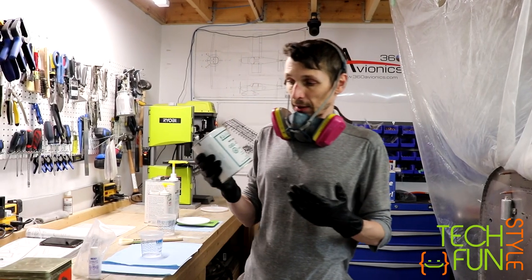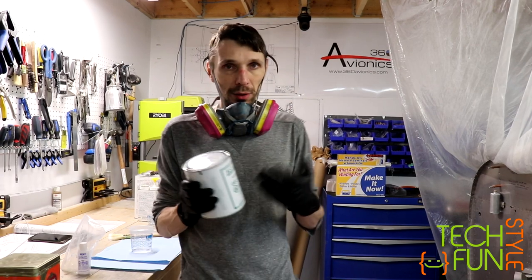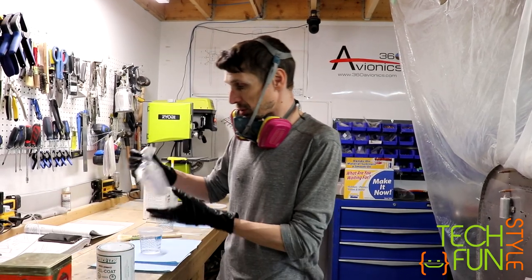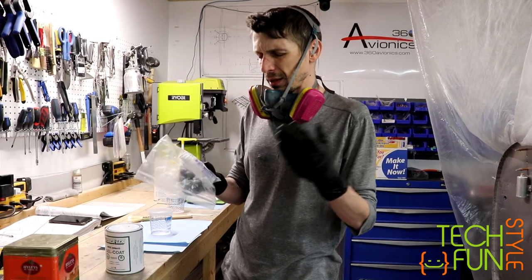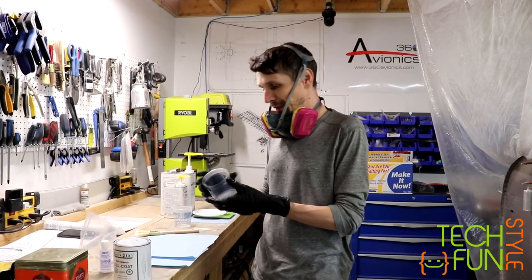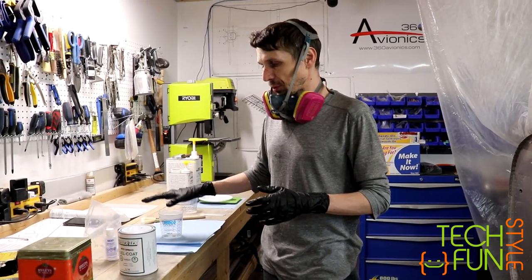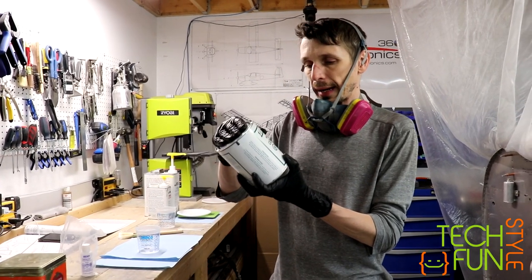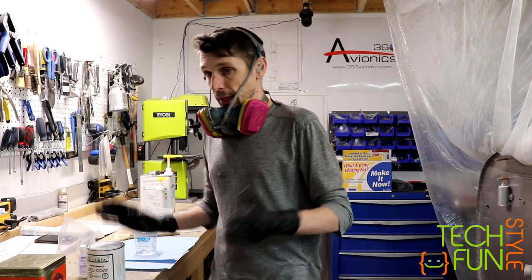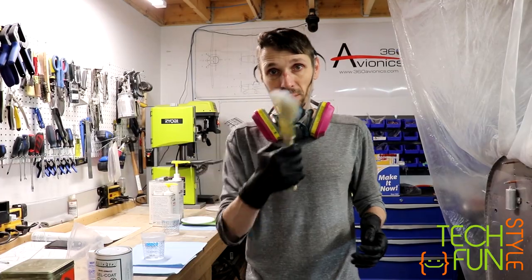So what we're going to do now is take this gel coat, which is white unwaxed from FiberTech. It's our local supplier, and we're going to apply it to our plug. The whole idea is to use MEKP, the catalyst, to premix it. Unfortunately that's the biggest one I have, so I'm probably going to be using about 300 milliliters. So probably I will need 3 of those or 2 of those. I don't want to premix a whole can because it's 946 milliliters, almost 1 liter, but I don't think I'm going to use everything. And we're going to proceed with painting using a regular brush. We're going to paint the whole plug in this white.